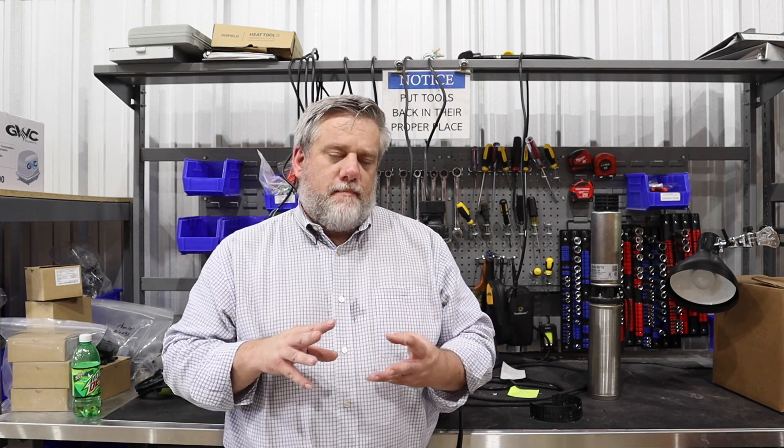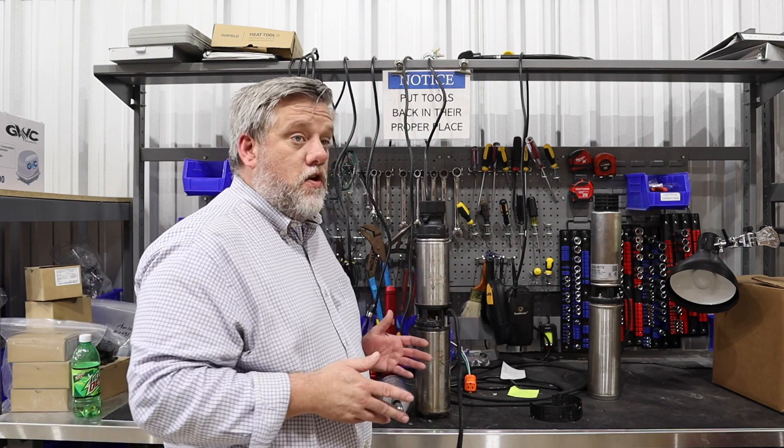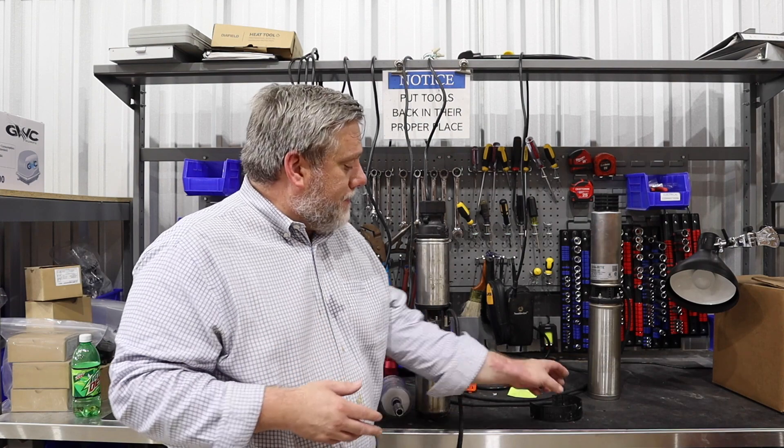It's also just advisable. If your pump's been in there nine years and you haven't pumped your tank and your pump just failed — you need to pump your tank. General rule is five people, four years; four people, you can usually go five years, depending on your habits. If you do that, it's not uncommon for these pumps to go 10 to 15 years, but you have to maintain the system in order for that to happen.